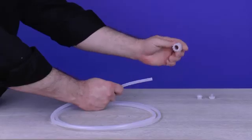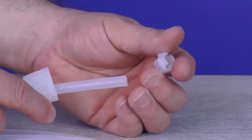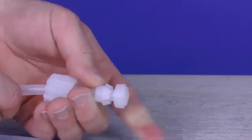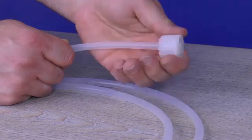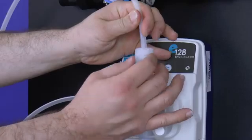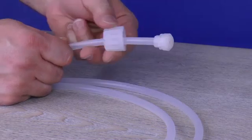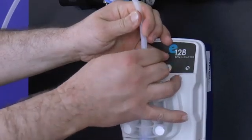Slide one end of the rigid polyethylene discharge tubing through the outside opening of the tube nut. Slide the collar onto the tube and make sure the collar's crown is pointing away from the tube nut. Grab the nozzle and insert the pointed end into the opening of the same tube. Push the collar and nozzle together as close as possible. Pull the tube nut toward the nozzle to compress the collar and nozzle tight together, forming a ferrule connection. Attach the tube and connections onto the discharge valve by hand tightening the tube nut. Do not cross-thread nor over-tighten. If the tube nut is not securing, recheck the ferrule connection — pull the tube nut toward the nozzle once more, then retighten until secure.